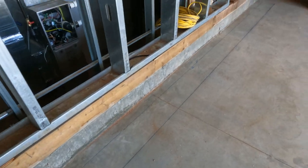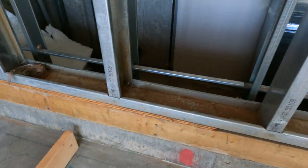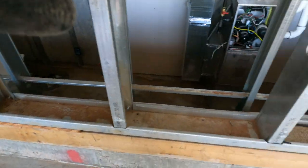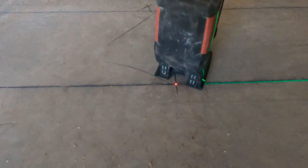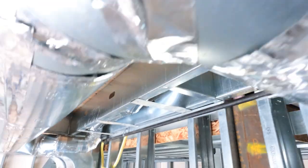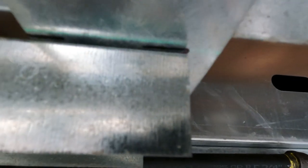Because of the scaffolding, I'm going to go up top. I'm going to build clips because the wall runs in between two joists. I use a piece of wood to set my laser. I plumb up the end of the wall since it's coming in on either end. I always put a clip where the wall ends — I mark a dot right there — and that's my stud height.